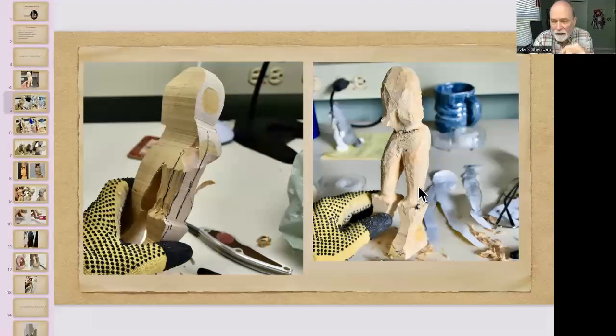The other thing I like about using the Typhoon bit is that you're really sculpting with it. You're just touching the wood, and you think, well, I need a little more here. You're not taking a lot of wood away as you would with a knife. You're just refining it. And so I find I have more control over the whole process of roughing in.